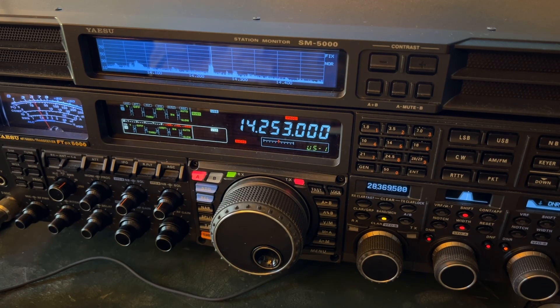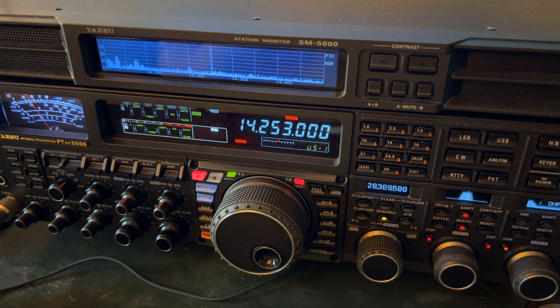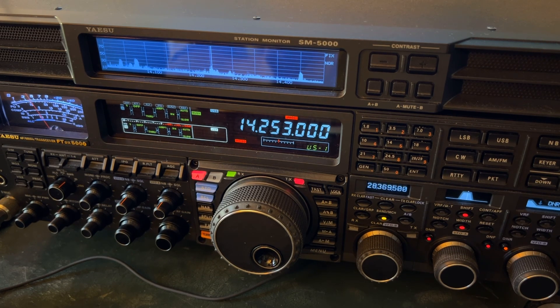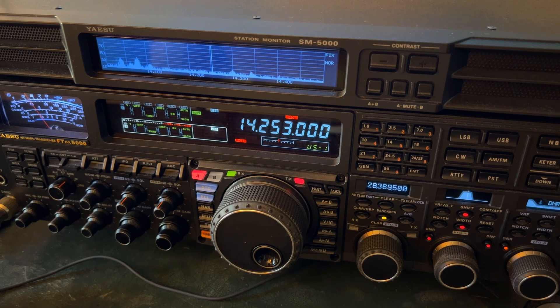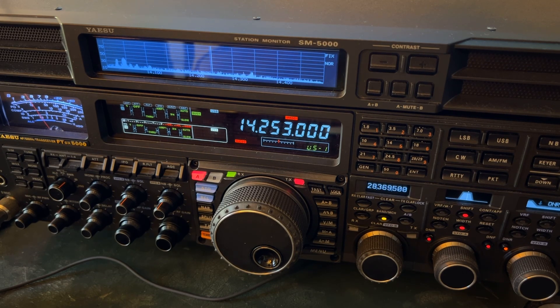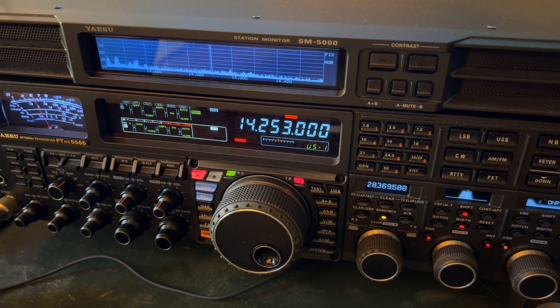Here's the deal. The audio spectrum, as far as our hearing and voice is concerned, the most intelligibility is coming from up in that 2000 to 2500 hertz range. By cutting out that metallic high pitch sound, I'm making it a little easier to hear the station I want to hear. Yes, I'm going to hear some of that low pitch honking sound, but while it's annoying, it does not take away from the area I need to hear. The high pitch metallic sound is up there on that upper end where the voice is most intelligible.